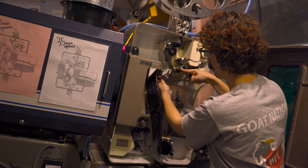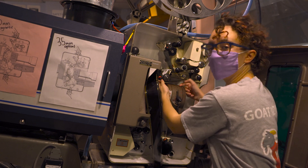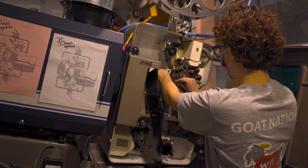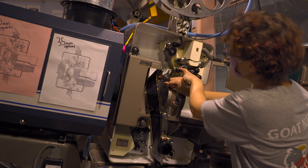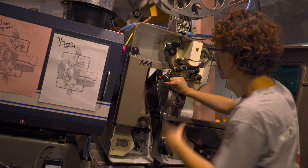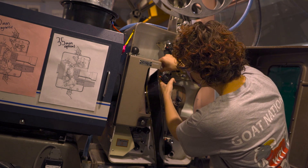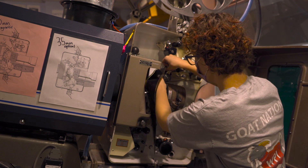Because the rollers move, the tension isn't exact, so we want to push back up against this roller to make the film show where the true spot of the arrows is. We pull up on the tension a little bit more until we get to the point where when we push back the arrows line up. It takes a few tries, but when you can push on this roller and see that the arrows are lined up, the tension is right. When you release it the arrows do change, but you want to check while applying pressure. That will ensure it's in the right spot when the projector is running. Once you're confident the tension in the sound reader is right, you can close this shoe just like you would with 35 and pull it down under.